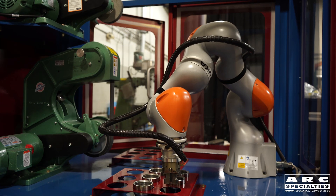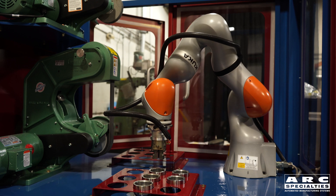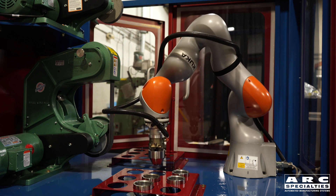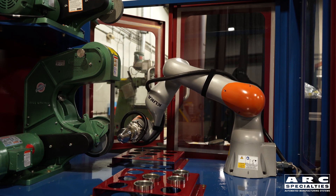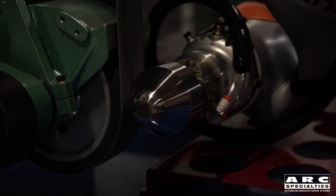One of the advantages of the KUKA IWA robot is we can use it in force-sensitive mode so it can detect when it doesn't find a part, or compensate for parts that are misaligned by wiggling around in a low stiffness mode. We're using 3M Trizact belts for their material removal efficiency and finishing power.